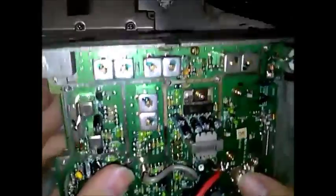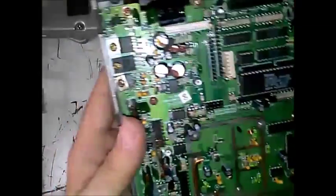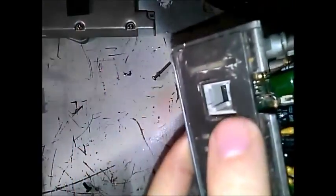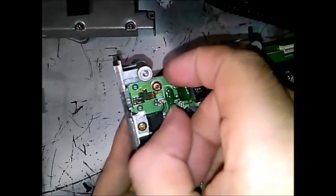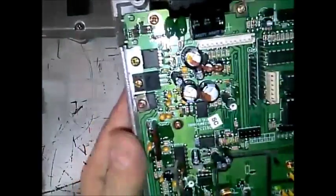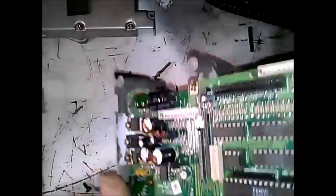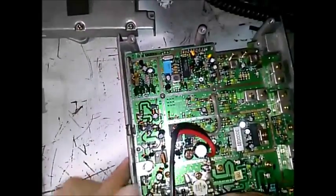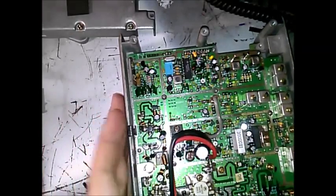Typical radio layout — this is on one side. The chassis is aluminum of course, and heat is dissipated here. The SO-239 connector accepts a PL-259. Over here is the command board with your microphone jack on the side, decoupling caps and all that. It's pretty straightforward — there's not much to it. Easy things to work on. Consider it torn down — I'm not going to take the boards off the chassis.